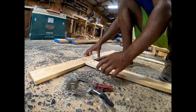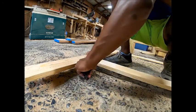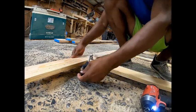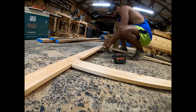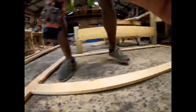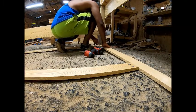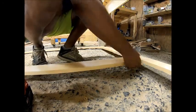On to the face — use pocket holes here again. All measurements are in the description below. Make sure you get the top of the bottom board lined up at the same level as that bottom shelf. You can do whatever configuration you want — if you want 10 shelves you can have 10 shelves, if you want cubbies that's fine too. These are about three-and-a-half-inch shelves so a phone or picture can sit on there. You can also always choose to make them deeper.